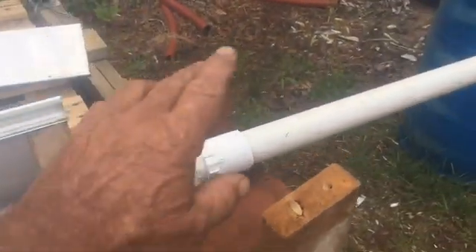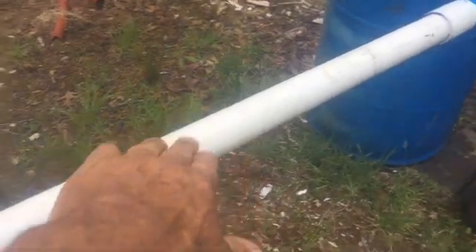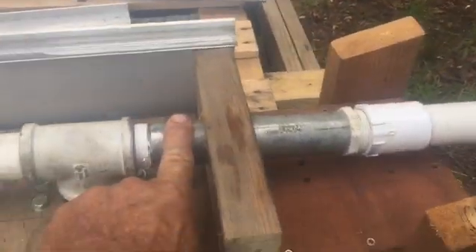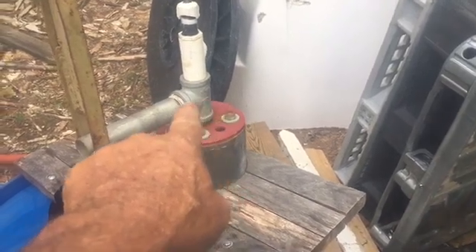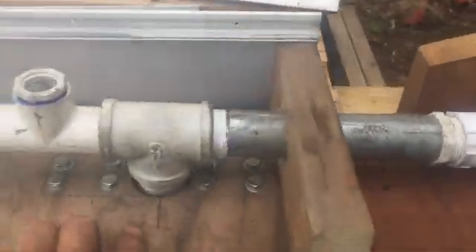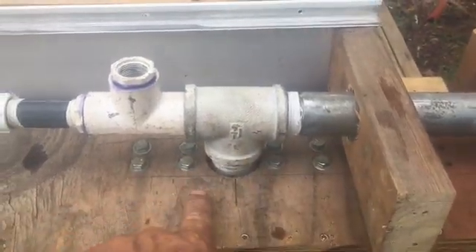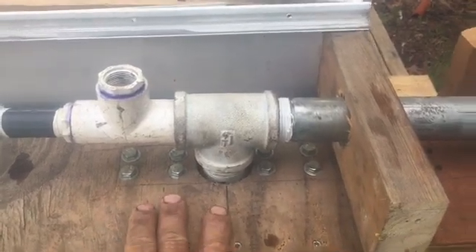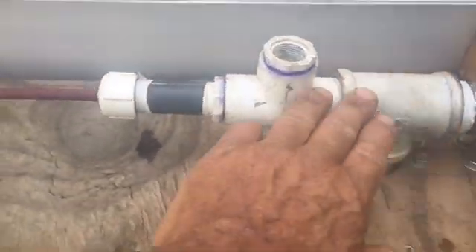The actual cylinder pump is the same as in the hand pump build — it's the same thing, just make it longer to get a longer stroke. This is your piece of steel pipe that would go through the well cap on top of your well casing, with the T coming out to hold the handle. When it goes in the well it just sits right here at the well casing — everything else is the same.